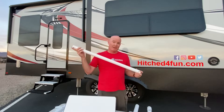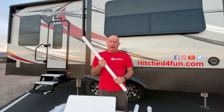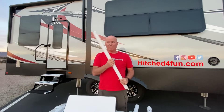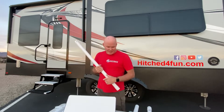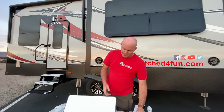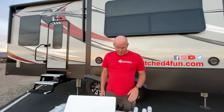These are made out of solid steel, powder coated for durability, and they don't flex. One of the things that really attracted us to this pole is the fact that it stays stationary. These dishes have a motor in them, and if you're on a flexible pole that's moving all the time, you're going to make that motor keep readjusting constantly. These poles hold it steady so you don't end up burning out your expensive dish.